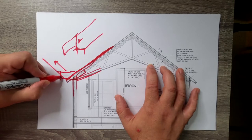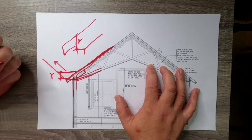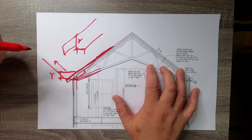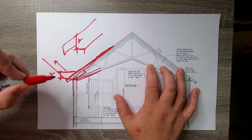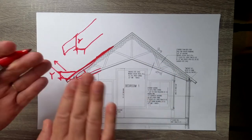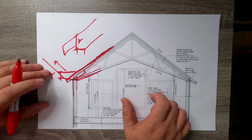So that heel height of Y really set up our heel height of the truss. We get that Y dimension — I believe it was just a little over eight inches or eight and a half inches — and we needed to set that. That way when they set the trusses, they can plane out that roof, sheathe across the roof, and we didn't have any conflicts.